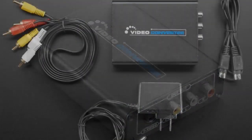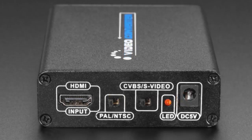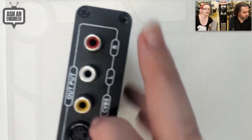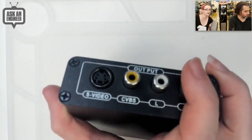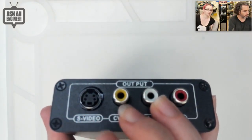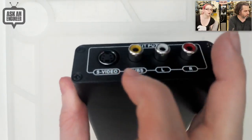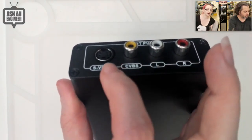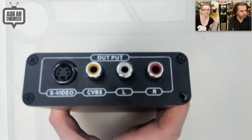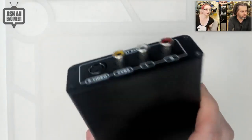Next up, another converter. This video converter goes from HDMI to S-Video or CVBS, which is NTSC/PAL. What this is for is if you have something with HDMI output but you want to connect it to a very old TV, an older projector, or some other device that has S-Video or NTSC. Another use case: if you want to read a video signal into a high-speed microcontroller or FPGA with an analog-to-digital converter, the S-Video signal is going to be a lot easier to read than trying to decode HDMI, which is extremely fast. This you can sample at whatever rate you want. But we think this is mostly for people who have an HDMI output with an older display.